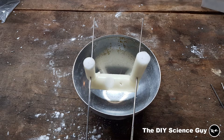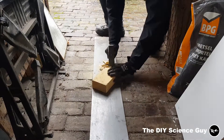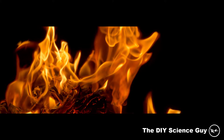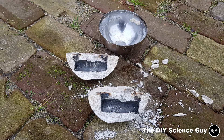To make a mold I made this simple wax piece from a candle and drilled a hole in it to see how well that would cast. I crushed up a fire brick and put it through a screen so only the dust was left. Then I mixed it 50-50 with some ordinary fast setting modeling plaster to make the mold fire resistant. Then I melted out the wax, poured in some brass and the mold held up pretty well.